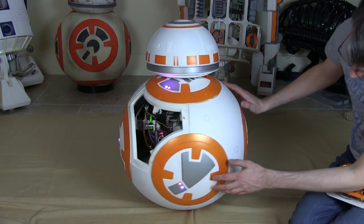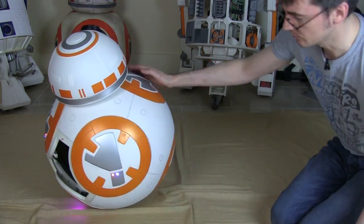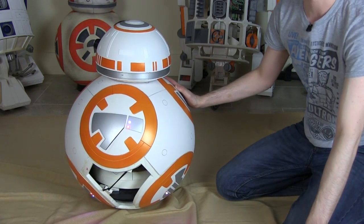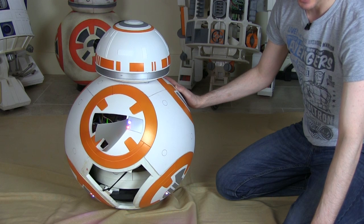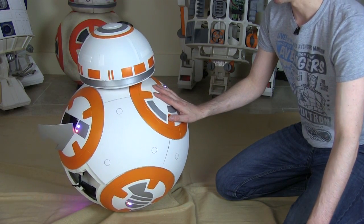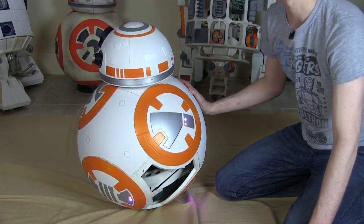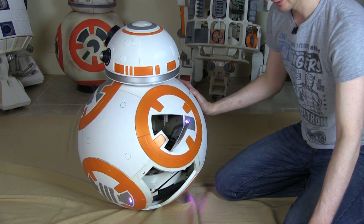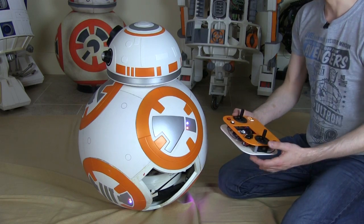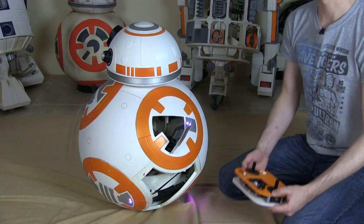So if we turn this round, the other opening panel is here, but nothing happens until I spin this round and it's upright. That's wired with a half-second debounce, so basically if I press the button and hold it permanently, it opens and closes. If I do it for less than half a second, it should open or close. It plays the sound at the same time, and that takes half a second to trigger, so if you're fast with your fingers you can sometimes get panels and no sounds. Of course, I could implement more buttons on the controller so I can control them independently or have a separate button for sounds and flaps, but I haven't — so at the moment that's still attached onto that button.